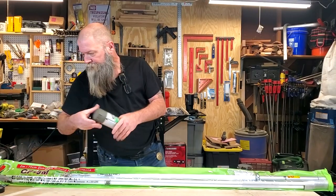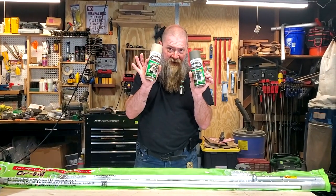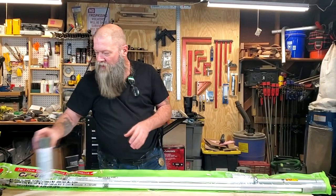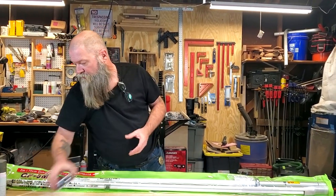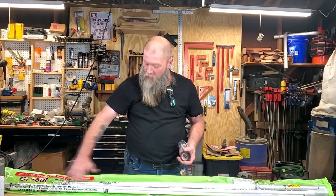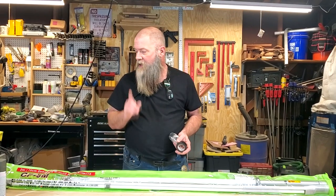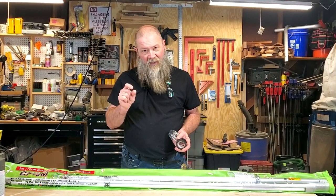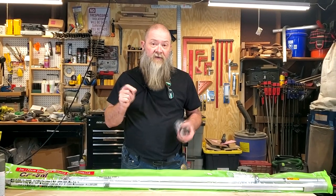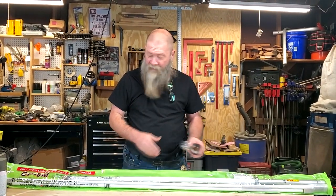So we're going to use a series of camouflage paints that I got from Lowe's and Home Depot to camouflage this thing. We're going to take some electrical tape and coax wrap to seal all the connections so everything on this thing is absolutely watertight. I also picked up some dielectric grease to help protect the connections when we assemble the antenna.